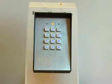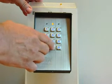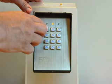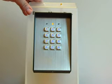To set user 1 on relay 1, press 1, then the location code 00, then any 4 to 8 digit number. In this case I am going to enter 1234 followed by four 1s, then pound. That confirms acceptance.